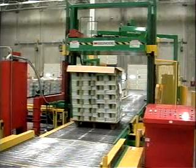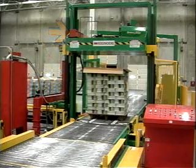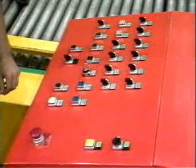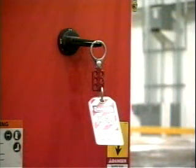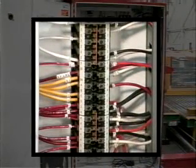Additional precautions should be taken to ensure that all electrical components are working properly. Keep all electrical covers closed to prevent operators from touching live electrical wires and to protect the equipment from dust and debris. Check illuminated controls for burned out bulbs, replacing bulbs as necessary. Be sure that all emergency stop and emergency platen up buttons and power disconnect or lockout switches are functioning properly and that they're included on all operator control consoles. Also verify that equipment interlocks are connected to conveyors and all other appropriate equipment, according to SigNode design and local codes.